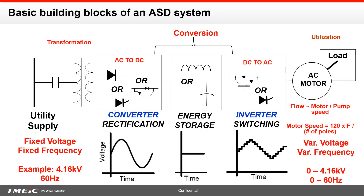If you look at a typical electrical illustration of an adjustable speed drive system, you have your load — a pump, compressor, fan, or whatever — and then an electric motor. Whenever we apply a variable frequency drive, our goal is to control the speed of that motor because if we can control the speed, we can control the flow or pressure. The most efficient way is by using an ASD. In essence, you start with fixed voltage and fixed frequency — 4,160 volts, 60 Hz — and through a two-step AC-to-DC, DC-back-to-AC conversion, get variable voltage and variable frequency. The motor speed equation is 120 times the frequency divided by the number of poles.